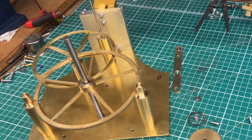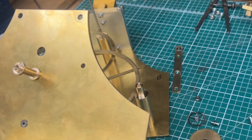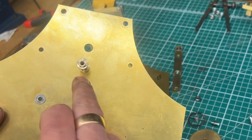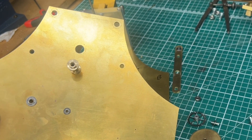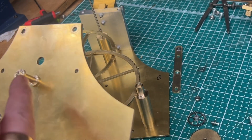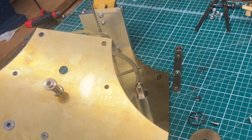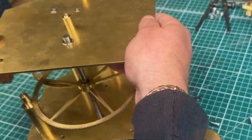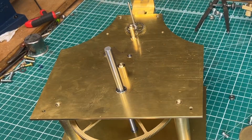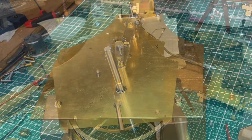I could have made these a little bit bigger, but I have had to turn down the standoffs. The second important thing — these two pillars are in the same place as where they should be, and yet in future I'd definitely just drop it down by five to ten millimeters for that top pillar. I should have seen that coming, but no problem — I made a little step on that pillar and it works fine. I'm going to attempt to put on the top plate now.